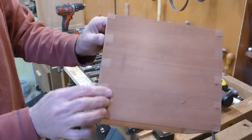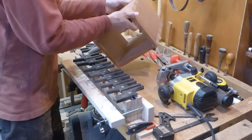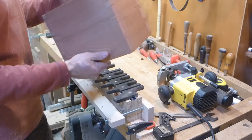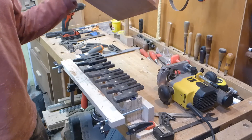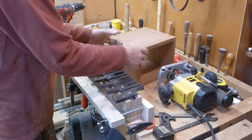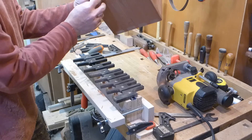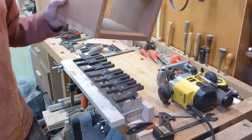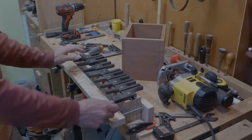You can see that's a pretty good fitting joint. It's probably a little snugger than I wanted — I might go back and wipe that a little bit. You do need to allow room for glue, but that's why I like dovetails: a nice snug fit without any glue. There are a couple places where I got a little tear out from being too aggressive, but I'll fill that with sawdust. That's the 3D printed dovetail jig.